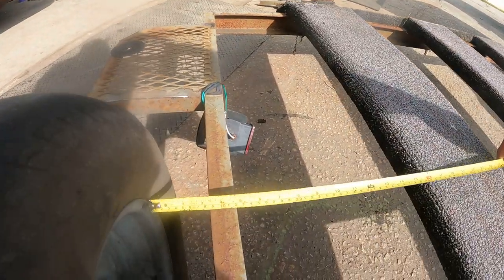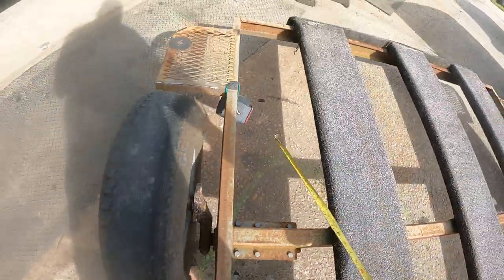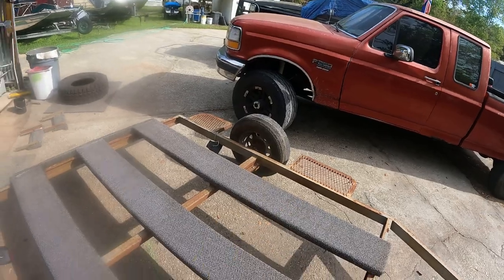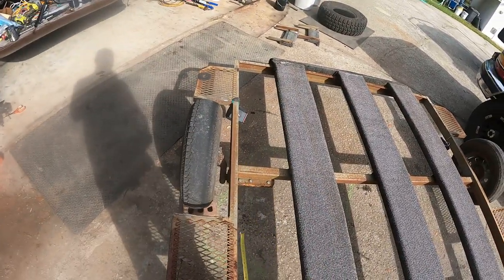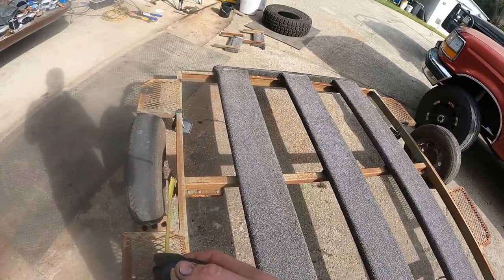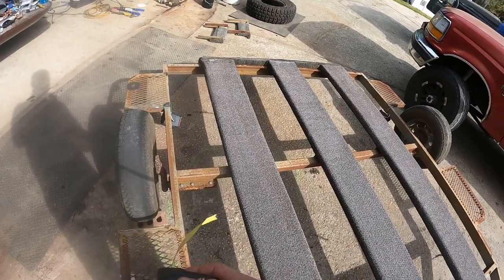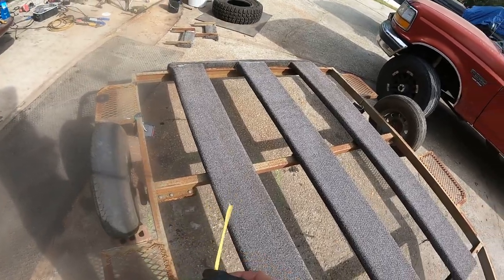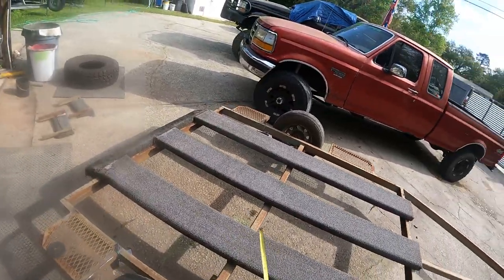These tires are completely out. Going off the rim to the edge of the trailer from the front and the back, there's almost three-quarters of an inch on one side and almost an inch on the other. I have to check the trailer for square first, and then I'll try to realign the axles when I stretch it out. It's definitely going to be better than what it is now — you can see it's just eating those tires real bad.